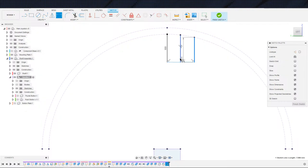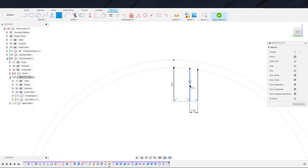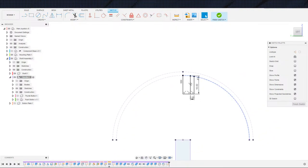And then this is going to be our wall thickness, which we're running with 2 for right now, as mentioned. And then it's a question of how much of the shaft we want to hold on to, which is this distance roughly right here. Actually, I'm right about that one. It is that distance because that's the wall right there. So this is literally how much shaft we're holding on to. We'll make that 10 millimeters just as a decision. It's a little less than half an inch. Yeah, 10 millimeters. I think I'm happy with that.